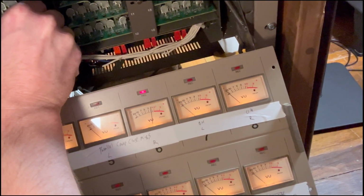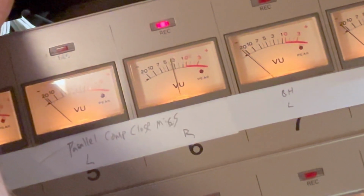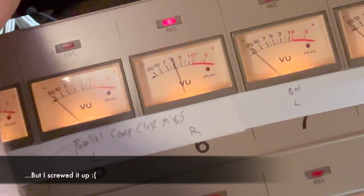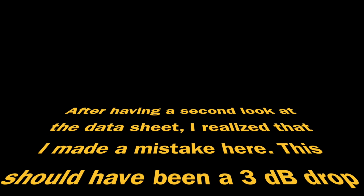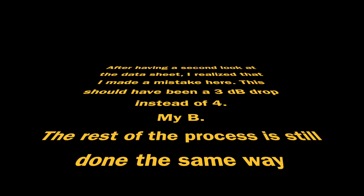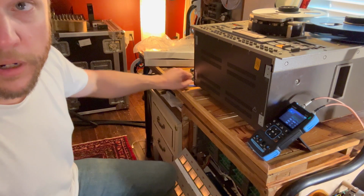So the -1 is probably our peak. So we're going to back it down to -5, which is right about there. There we go. Now it's properly biased. I got to do channel 7 since I hooked that one up. All right, I fixed channel 7.